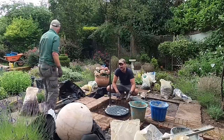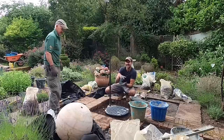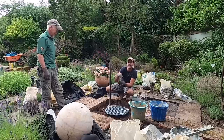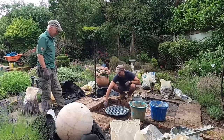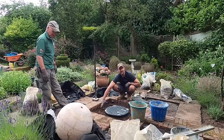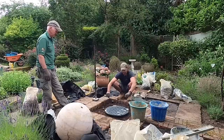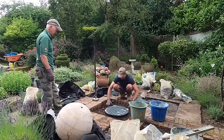And that's also important — cobbles are quite expensive. A 20-25 kilo bag of cobbles here in the UK is now selling for about six or seven pounds. So we want to try to minimise how much of that expensive material we're using — soil in the garden is free. I've filled this up a little bit more with soil so that we're using slightly less cobbles, but still making sure we've got a good depth that we're not going to reveal the reservoir beneath. All the cables and conduits fed into here have been made sure that the ends are above soil level, and the open conduit has been blocked up with a little bit of felt just to stop any soil and rubbish from falling in so that it can be used in the future. And I wanted to make sure that all the cables weren't buried in the soil but were sitting just underneath the membrane that we're going to lay down next, before the cobbles go down — so that means it's quite easy in the future if we need to find something: just move the cobbles aside and pull the membrane back to reveal the conduits and cables.